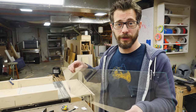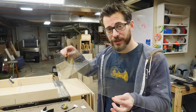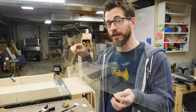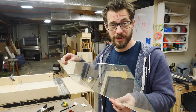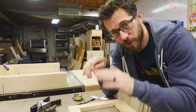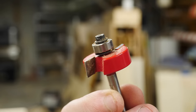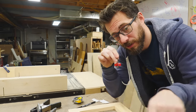The glue is all dried on that frame so now we're ready to start working on putting in the glass. This glass was cut at Lowe's but unfortunately we're going to have to knock it down a little bit smaller to fit in the door. To place the glass in the door we first have to make a rabbet for it to sit in. We're going to use a rabbeting bit and a router — it's got a little bearing on it that will ride on the inside edge of the frame and just cut out a little shelf all the way around.